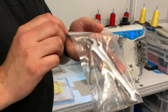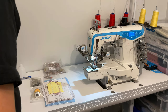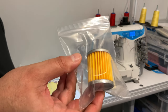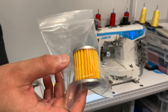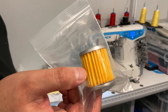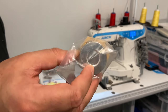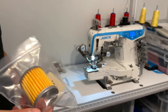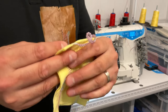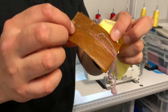The machine comes with tools — basically Allen keys and wrenches, pretty much everything you need to get set up. It also includes an extra oil filter. The manual says to change it after two months, but the dealer said after two years you're probably fine depending on usage — if you're in a factory running it non-stop, maybe two months; if using it less, no need to change it every two months. Every Jack machine also comes with a test piece that was sewn on the machine.